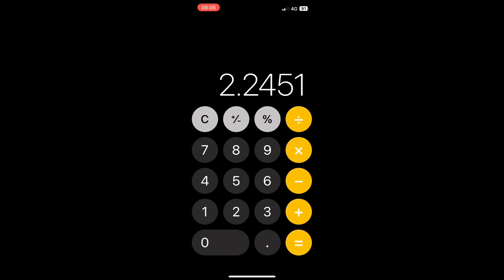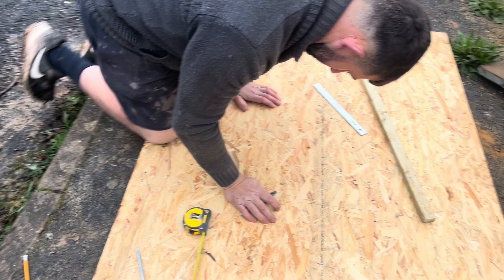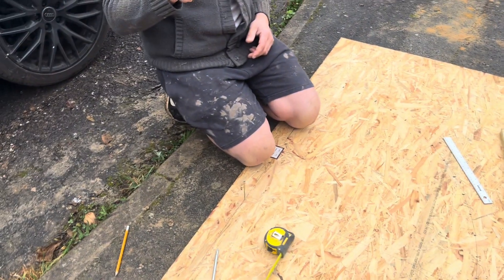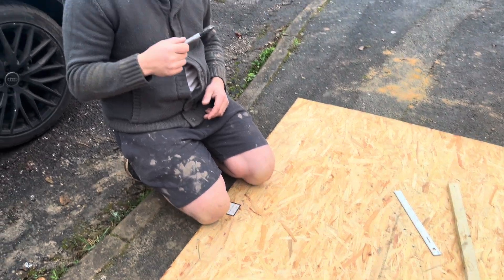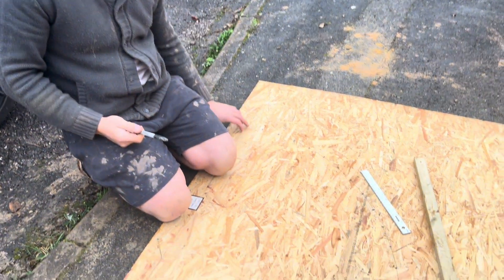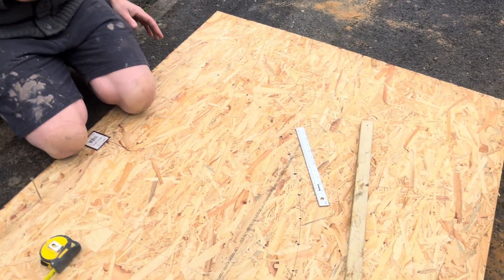Then you've got to make an educated guess — you need an odd number. I knew it was going to be high in the 20s, so I went 29 and got lucky. But if you wanted to be sure you could go 31 and have them slightly smaller. From the calculator screen recording, we found out the voussoir size was 77mm — but that includes the joint.